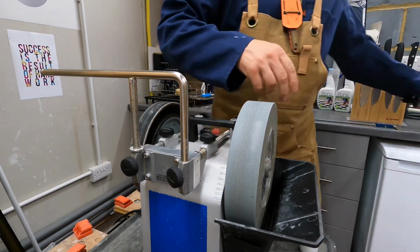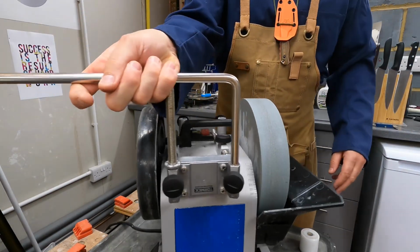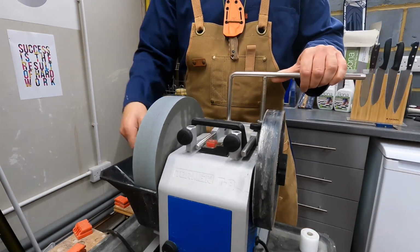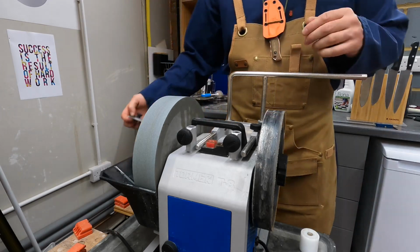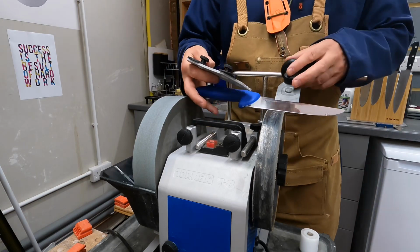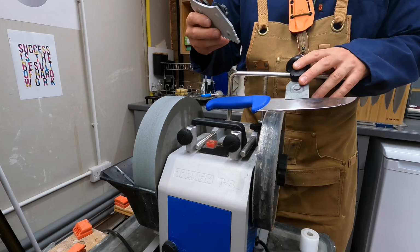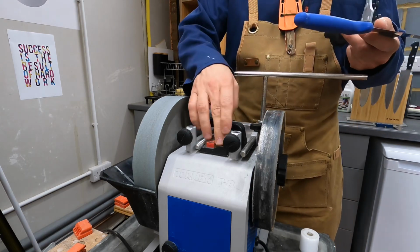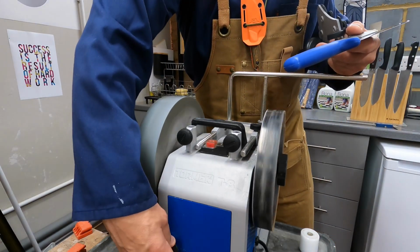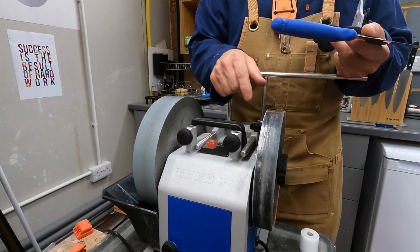flip this over, and actually I'm gonna then spin my Tormek around. As you know, always pass with the grinding wheel passing in front of you. That's my view. It keeps the electrical cable nice and tidy. But now with the FVB in place, I can set up for edge trailing honing. Just gonna drop the water tray there, and match the exact angle that I sharpen with on the honing.